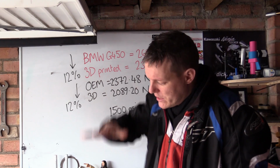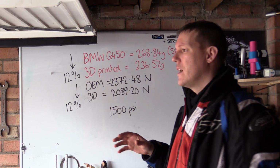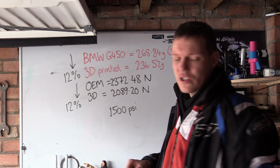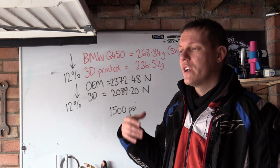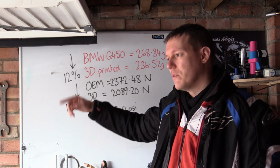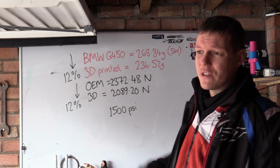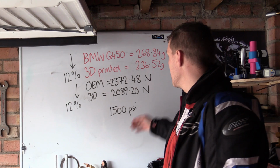Now, this is actually just the acceleration of the whole thing. There is no piston slap put into that or anything like that. But you can see the forces, where they lie, stuff like that. And we're not including stuff like the compression. When the piston goes up, there's a resistance force, which makes it go a bit asymmetrical. It's not a nice, pretty curve like that. But anyway, at 15,000 RPM, you're going to see lower forces, which is fantastic.